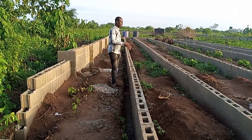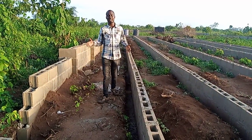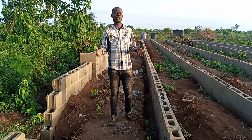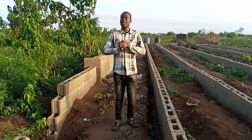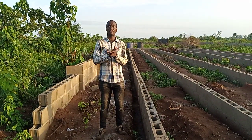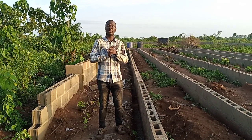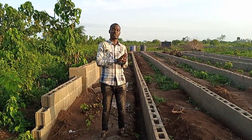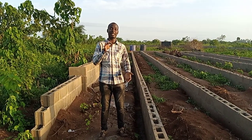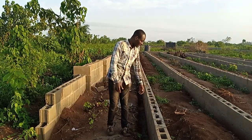So this is the way to put pillars in the house, and the pillars are used for sustaining the building so that the building will be firm. So this video is specifically done for our client. I am telling him the total number of pillars we need for this project. We need 20 pillars for this project, and the height of the pillar will be 12 feet. 2 feet will go into the ground.